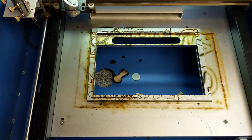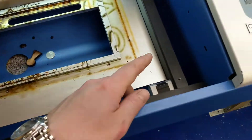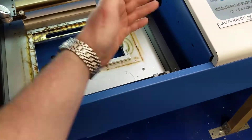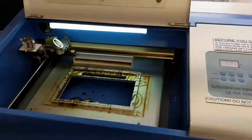Another fairly interesting point: it does have limit switches there and there, but it doesn't have them down this end. So you can actually drive it too far that way and too far that way, which isn't good. You've just got to be very careful with that.